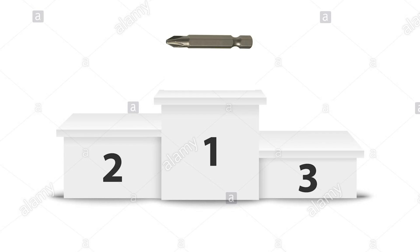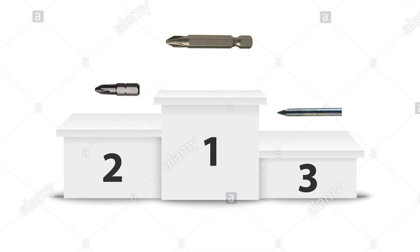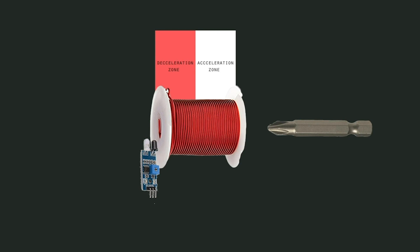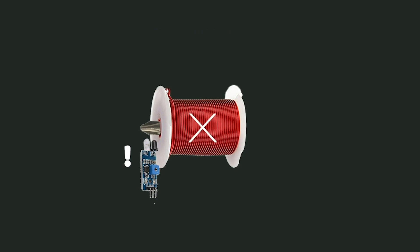In terms of projectiles and damage, the long screwdriver bit wins the competition, and I'd say the shorter drill bit takes second, and then the nails come in a close third. I think for the final version, I'm going to redo the coil so that they're around the same length as my projectile. That way, right as the projectile reaches its maximum velocity, it'll be right there at the sensor, and then my circuit will know to shut that coil off.